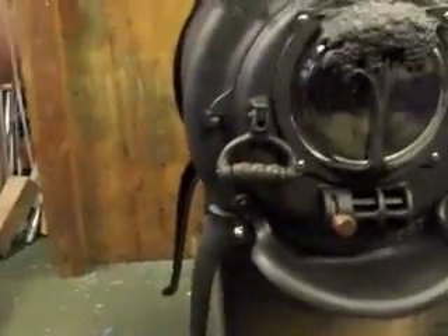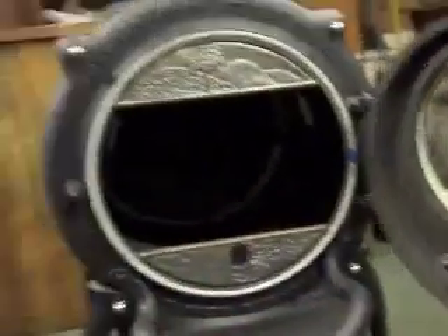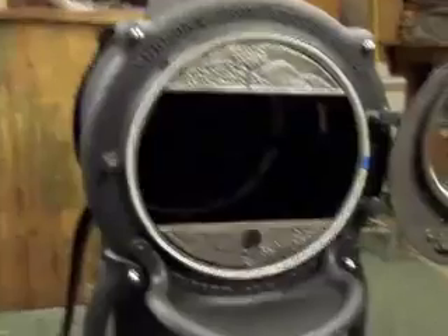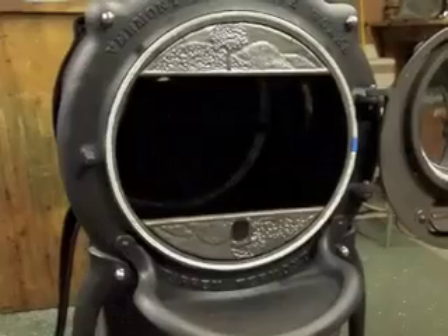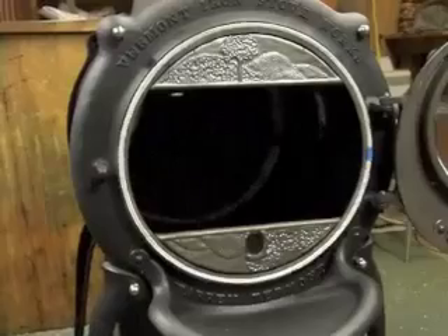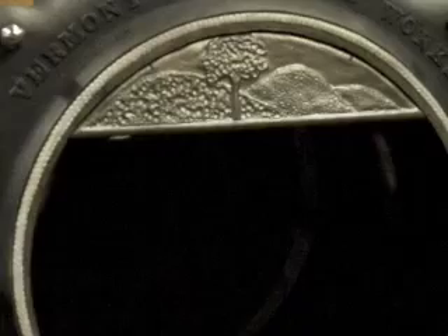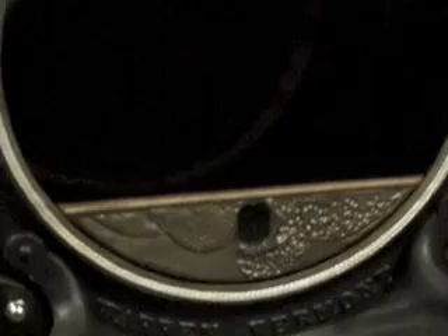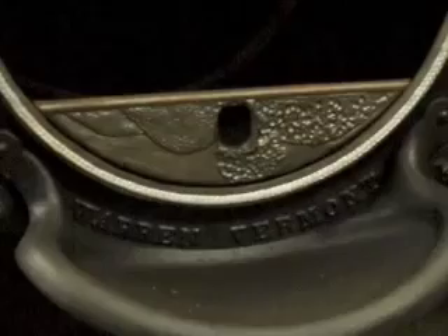With the original lift-up handle. And what I told him was that originally the opening for the door was a complete circle. Often times if you yank the door open quickly, smoke would come out into the room from the top. So what I did was install this cast iron piece on the top, which is like an air dam. And there's another air wash in the bottom — basically the same piece turned upside down with a hole cut in the center, which acts as an air wash.